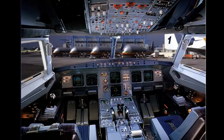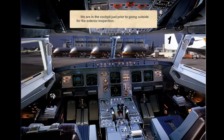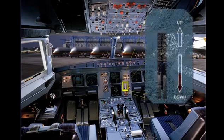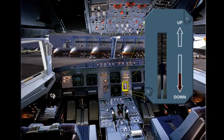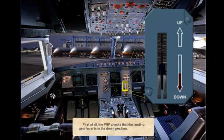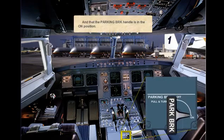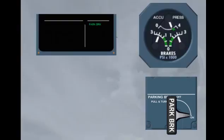We are in the cockpit just prior to going outside for the exterior inspection. First of all, the pilot non-flying checks that the landing gear lever is in the down position and that the parking brake handle is in the on position. On the engine warning display memo section, parking brake in green indicates that the parking brake handle is in the on position.